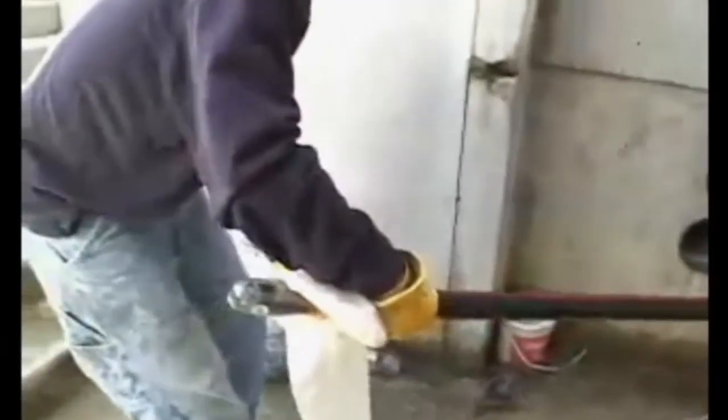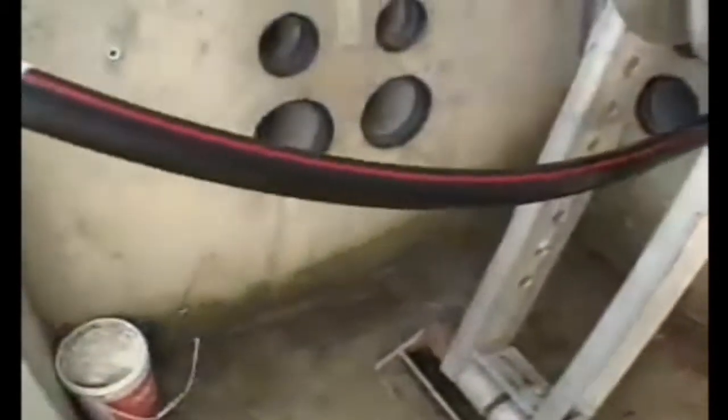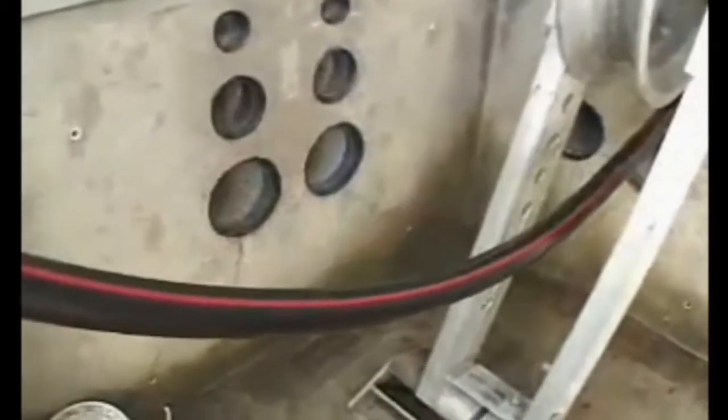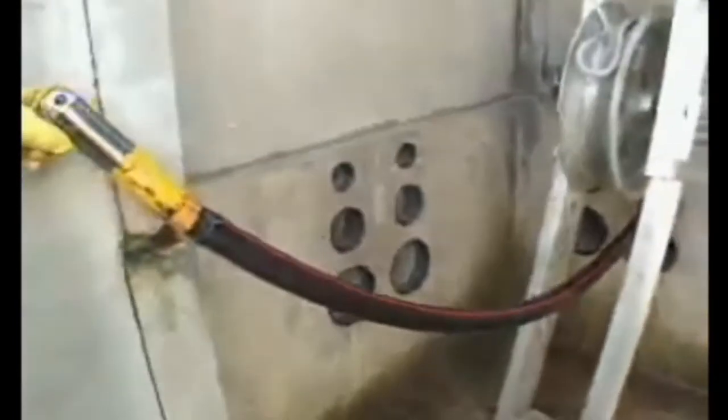A general rule of thumb is to use one gallon of cable pulling lubricant for every 100 feet of cable being pulled. After the pull has been completed, cleanup is easy. Get a clean rag and start four to six feet back from the end of the cable. Tightly squeeze the rag around the cable and squeegee off the lube as you pull towards the end. Fold the rag over, exposing the dry part, and repeat. Your cable should now be clean and dry, ready for taping and termination.